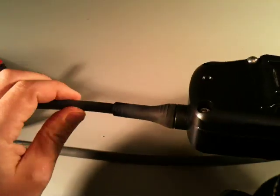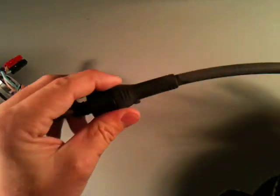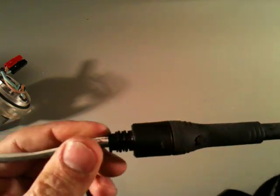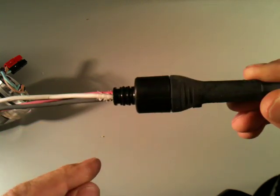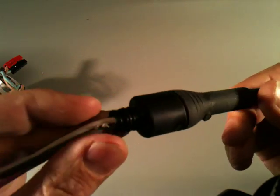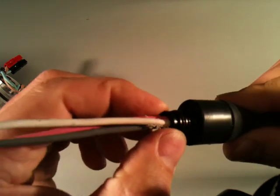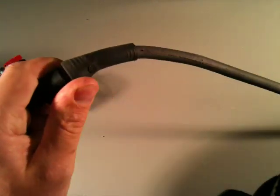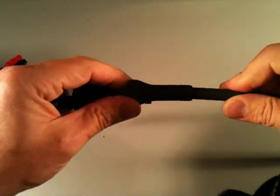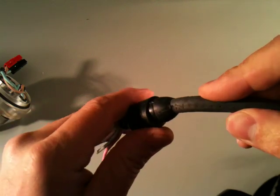This is the cable — both ends are the same. There's a strain relief there, and we've got one that is not connected to the canister or the light head right here. We've got an aluminum boss down the bottom with a couple of O-rings, so this plugs into the canister or the light head and gives you a really nice seal right there. Then, over-molded for a good seal all the way around this aluminum is this plastic molding right here. There's a strain relief to keep everything nice.